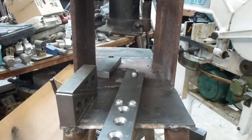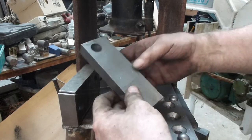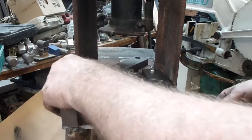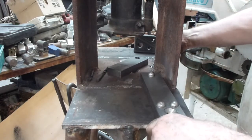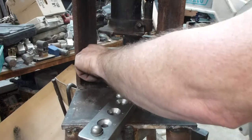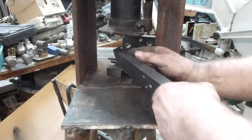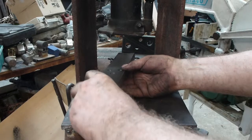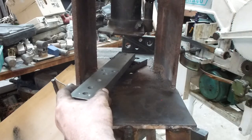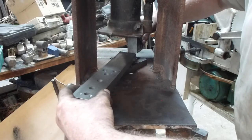So this is a somewhat wider view so that you can have an idea about how this is going on. It actually put a couple of dimples in the steel bearing in the lower plate, which I was sort of wondering whether it would do. It doesn't matter, this is just a piece that I have as an offcut. So, the two 8mm drill bits back in place to allow me to press the bearing into 8mm without going further. I would like them all to be the same, which is a fairly reasonable sort of thing to want. Whoops, I haven't put the other one out of the spacer in.